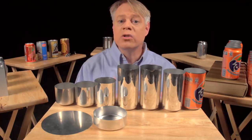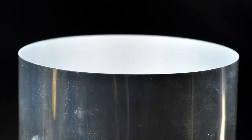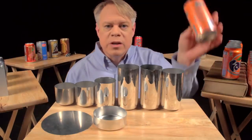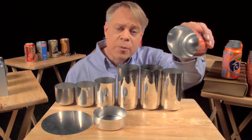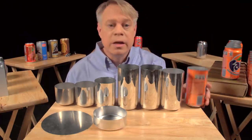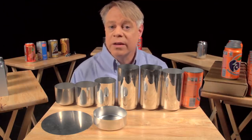If you look closely at the top of the can body, you see that the edges are wavy and uneven. These irregularities occur during the forming, so about 6 millimeters is trimmed off the top to get a nice, even edge. With an even top, the can can now be sealed. But before that sealing occurs, a colorful design is printed on the outside — the term of art in the industry is decoration. The inside also gets a treatment: a spray-coated epoxy lacquer separates the can's contents from its aluminum walls, preventing the drink from acquiring a metallic taste and also keeping acids in the beverage from dissolving the aluminum.